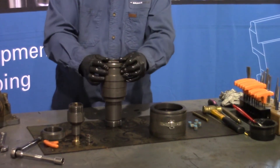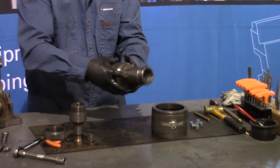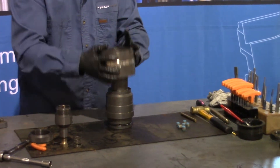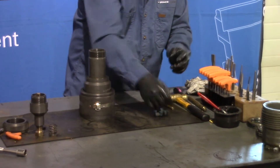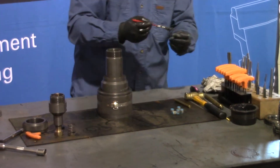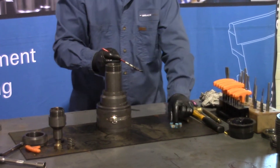Install our O-ring onto the bottom of the union. Install our nut onto the body. We'll take our stuffing box packing — this one takes six pieces — so we'll grease up the stuffing box packing.